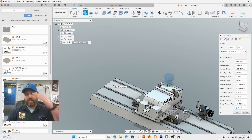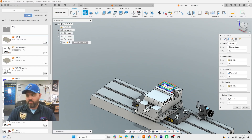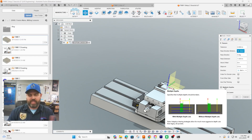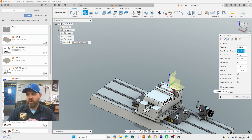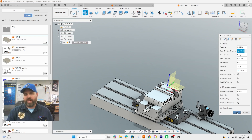In manufacturing we could face this off very quickly, but I'm going to teach you how to do multiple depths, which allows us to take multiple passes to face off all of this material. Skipping the Multi-axis tab as we don't use it — under Passes, we cannot do it in one pass. We're learning how to do multiple passes, so click Multiple Depths and change the maximum step-down to 60 thousandths. It's going to take 60-thou passes, coming down and shaving until we get to our finish height. Click okay.